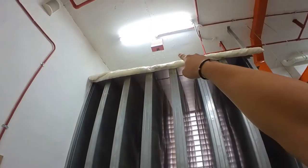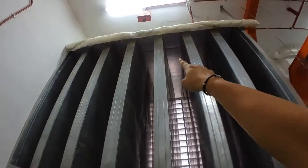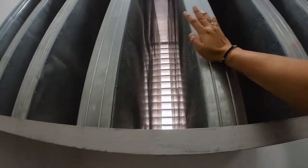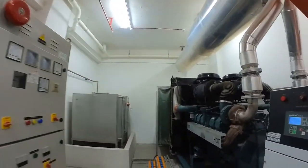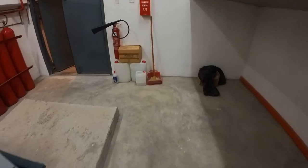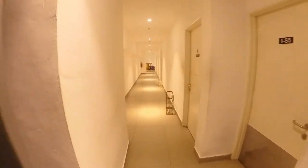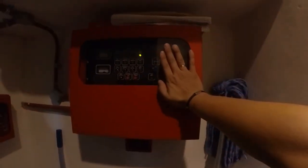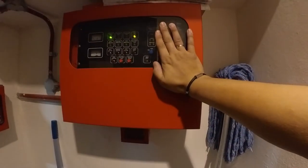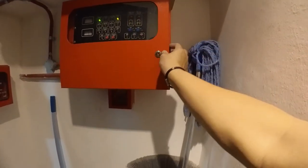All right. And then this one, the fire curtain. Once activated, the CO2 system has to be released and the curtain comes down and blocks this. If, let's say, you have a ventilation fan, the ventilation fan must be off. Okay, and do make sure before any bomba testing, your CO2 panel is in good condition, especially the cable, the sensor cable, and also the battery, the internal battery.